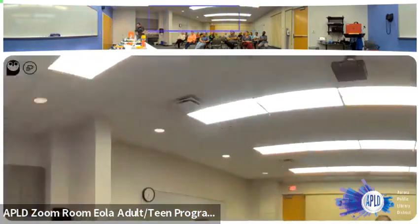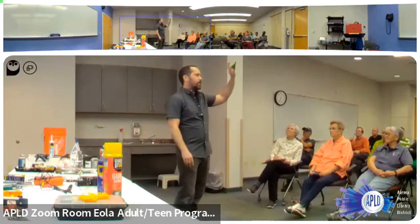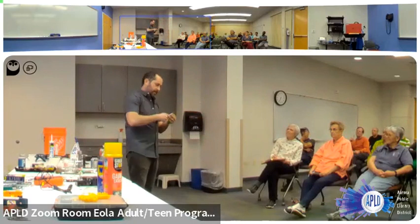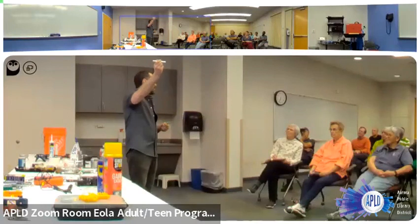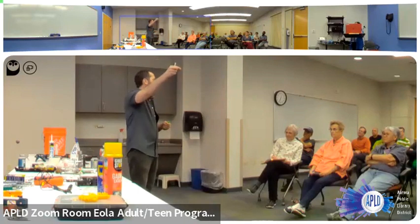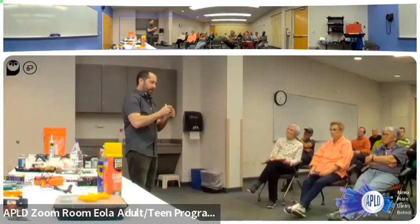You only need one screwdriver for about 95% of the stuff in your home, and it's this one right here. Okay, this is what we call a 6-in-1, all right? The 6-in-1 is cool because the shaft pulls out right there, okay? The ends of the shaft are 2 of the 6, and they are a 1/4 inch and a 5/16 inch nut driver, okay? Then you've got a big and a little Phillips and flathead, okay? Flathead is the minus sign, Phillips is the plus, all right? Some of you, this is remedial, that's okay.